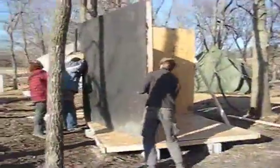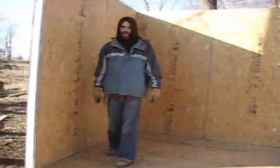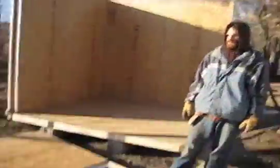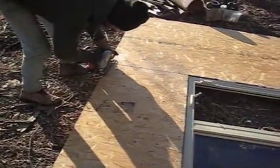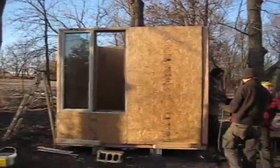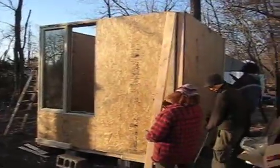The solar cubicle rests on cinder blocks and it's insulated on all six sides. The total cost is about $380 without the stove. We use driveway sealer for paint. We found out that it's the only type of coating that can be applied quite easily in near freezing or even freezing temperatures, as opposed to paint or tar. The driveway sealer remains quite fluid in cold temperatures.